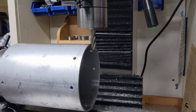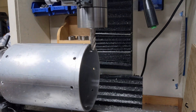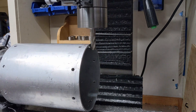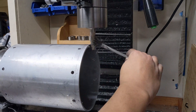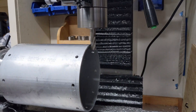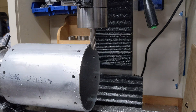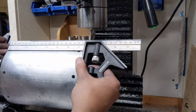While I'm here I might as well square this edge too, but anything longer than this 7.5-inch tube and you'll get way too much chatter. Indeed, for the other 12.5-inch tube I was making, I had to remove it and re-chuck it as well as re-indicate it again. Nice and square.